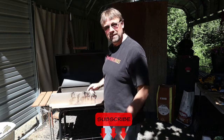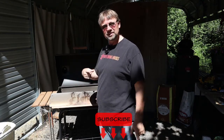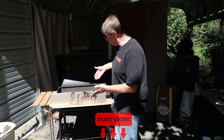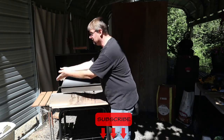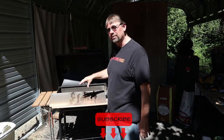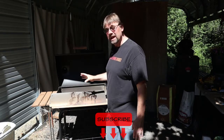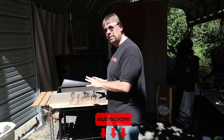Bear with me — I can't see anything because the sun is directly in my eyes, so I hope you can see me and everything looks good. This side over here is where the firebox is, so I'm going to take my angle grinder and cut a series of slots in it. Now if I do use it for charcoal, the ash will be able to drop through, and it will also increase the air circulation, allowing the charcoal to burn better.